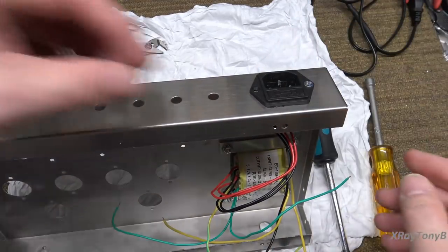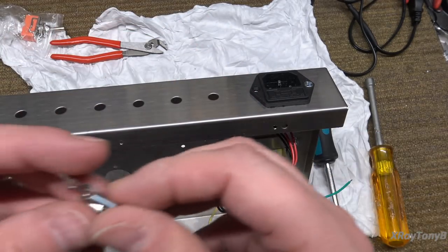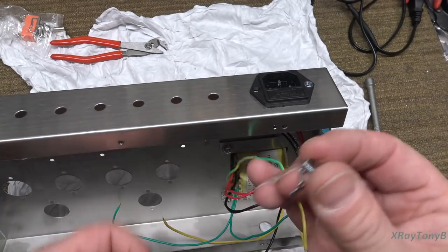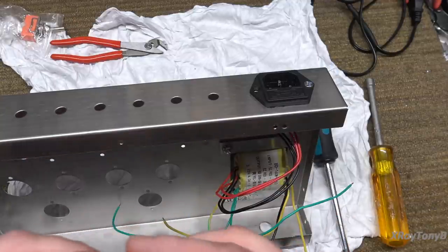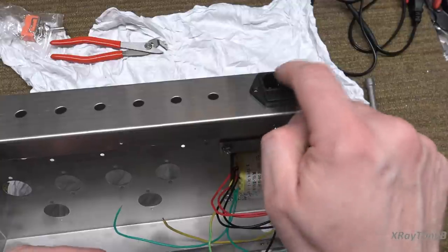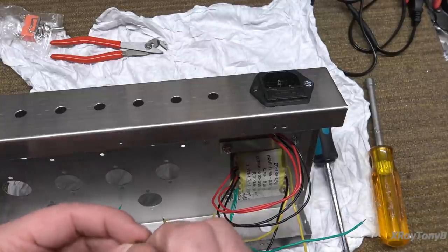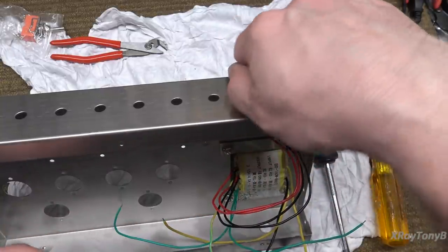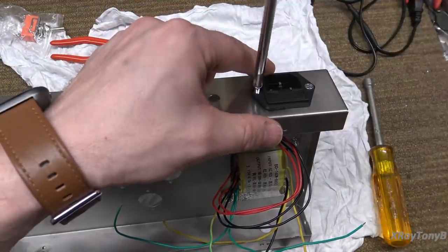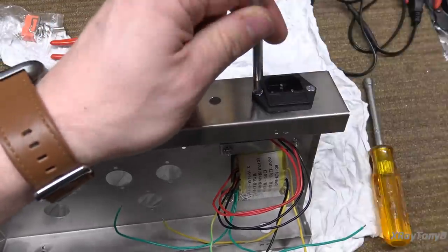This other screw is a little bit longer because I'm going to put a ground lead on there so we can ground the shielding of this transformer to the chassis. I also want to ground the center prong of the mains outlet to the chassis so it can be earthed as well. I want it to stick up a little bit — I could have used a shorter screw but I'd rather have it slightly high. That's personal preference.